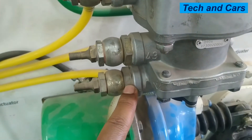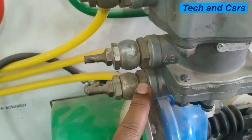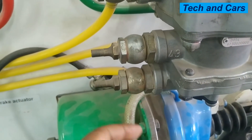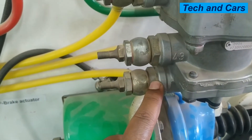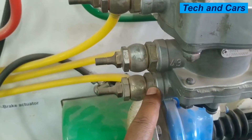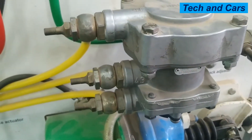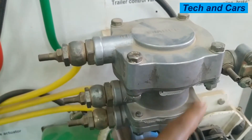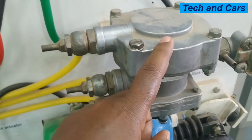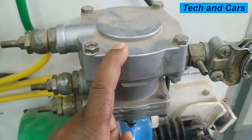Line 42 is connected to the second circuit of the service brake valve or the foot valve. If line 42 is pressurized, the trailer brake will be ordered to apply. If line 41 is also pressurized, this regulator trailer control valve allows the trailer brake to be applied.